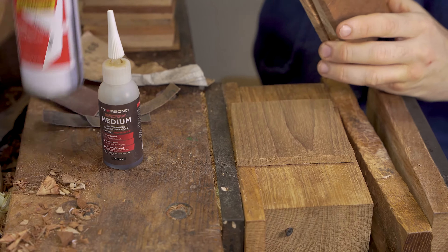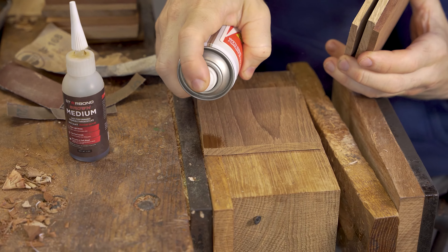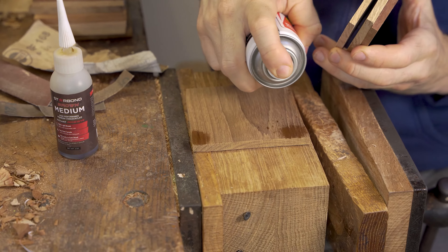Hello and welcome once again to our family workshop. In this video we are focusing on scroll saw bird projects. On these particular ones we're starting to get a little bit more creative. We're using stack cutting as a method once more, using that Starbond super glue and the accelerant where we put four little dots of super glue in the corners of four different pieces of wood, then stick them all together in preparation for doing your scroll sawing.